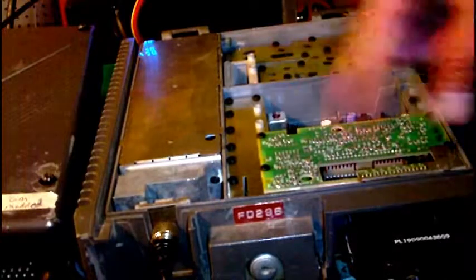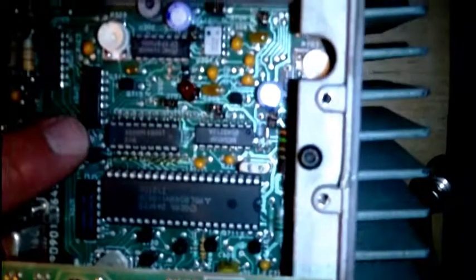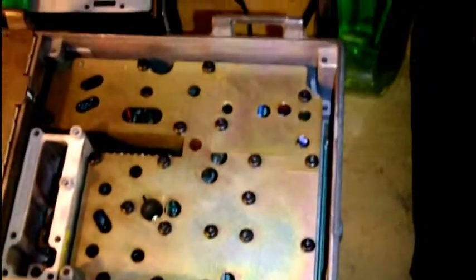I'm going to take the camera off the tripod and look down inside. This PC board is pretty much the little microcomputer — the CPU is here, the memory chip which is an EEPROM, erasable programmable read-only memory, and this is what you have to program. It has pins sticking up out of the board for certain programmers. Behind that you've got the transmit/receive synthesizer board.